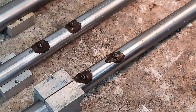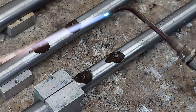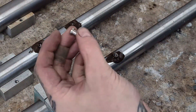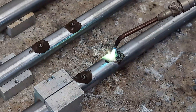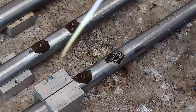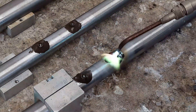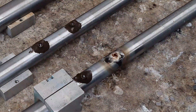So we're going to start with one of these water bottle bosses here. Once I get a neutral flame on my torch — nice sharp cone — we've got our black flux and one of these little stainless steel water bottle bosses already in the tube. I heat up around the bottle boss itself, and then once the flux starts to look glassy, that's when you know it's ready to take the silver. I'll just do a dab of silver on each side, and then the silver follows the heat, so you can just do a couple of circles around.